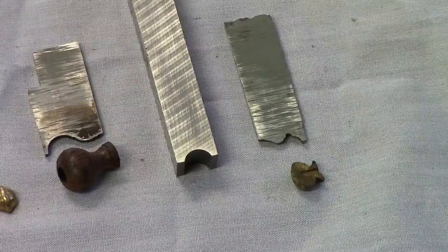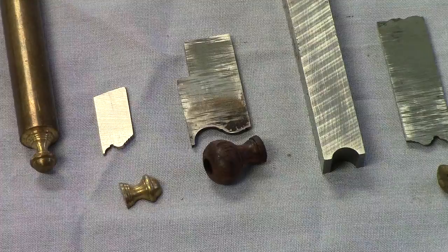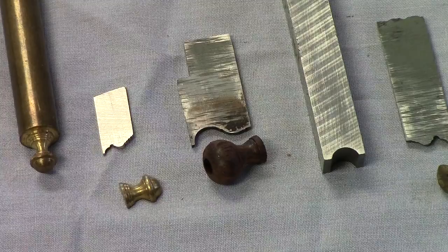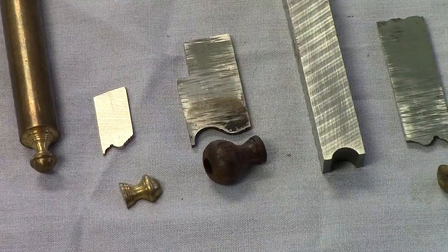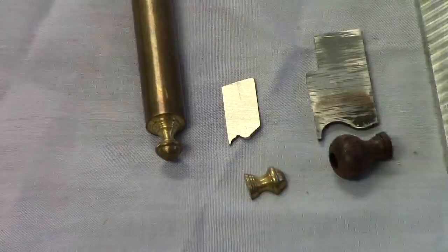The third one over is a profile cutter that was used, I think this is also 50 thousandths hacksaw blade, for turning knobs, repetitive turning of knobs for a miniature plane. The profile can get pretty detailed by sizing and trimming your abrasive wheel to get into some really tight corners. An example of that is the last one here, which was a top for a miniature plumb bob.